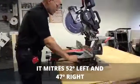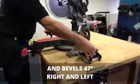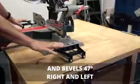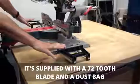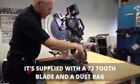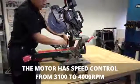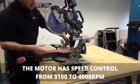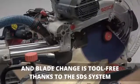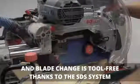First of all, we have something that's becoming quite common with our benchtop saws now, integrated material supports. So if the unit's being used on a workbench, you can simply slide these out, gives you a bit of extra support for longer work pieces. The back fence, of course, is also adjustable here, so you can move these sections out by loosening the wing bolts, and this again gives additional material support, or you can remove them completely when you're doing compound miter cuts where the cutting head might interfere with those back fences. So take them off, move them out, close them in, whatever you want to do.